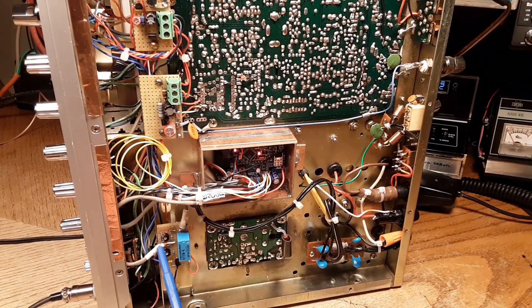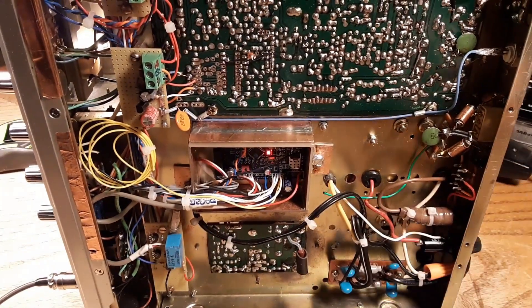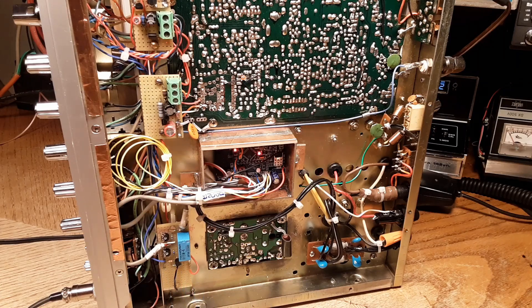As I covered in my video on the 142 GTO, I did the same thing here — the exact same board but it switches a little differently. The SSB Roger Beep level is here and the AM Roger Beep level is here; they're completely independent. That solved the issue with beep volume. I just have to figure out where the connection is missing between that Arduino pin and that reed relay. Thank you for watching my videos — take care and have a great day.